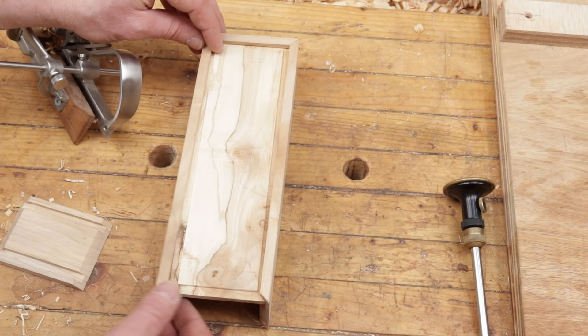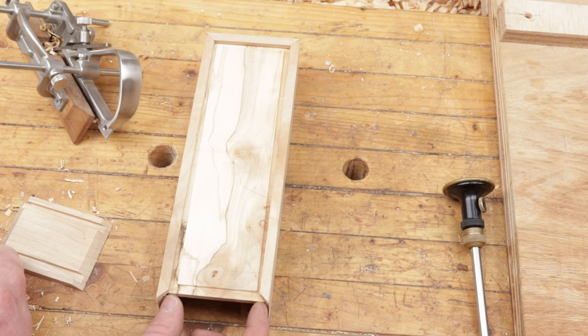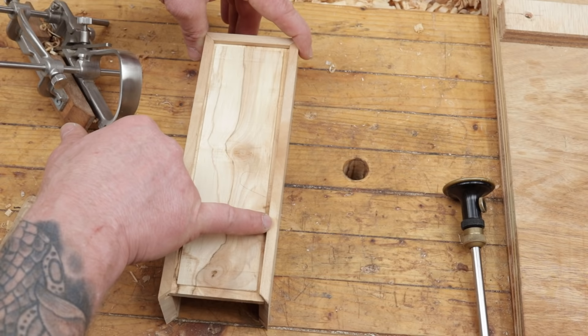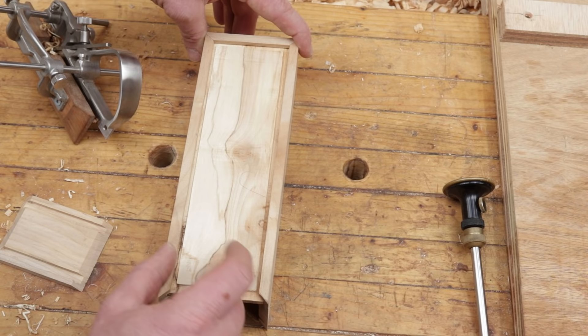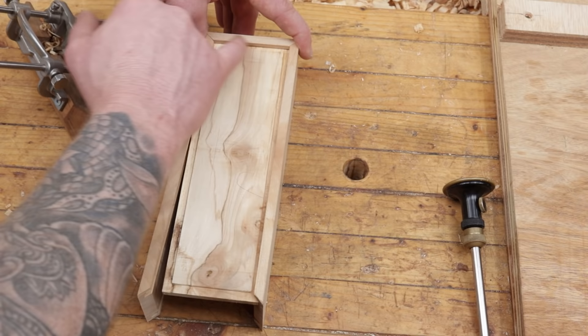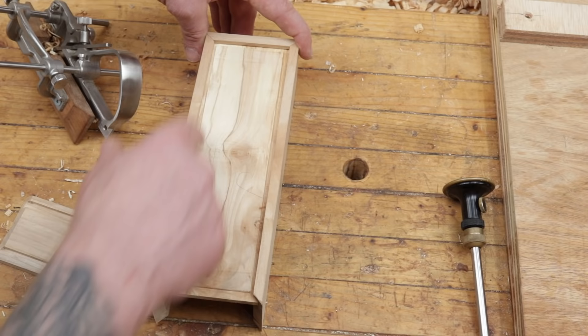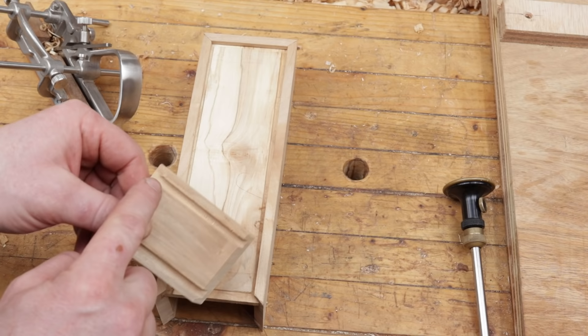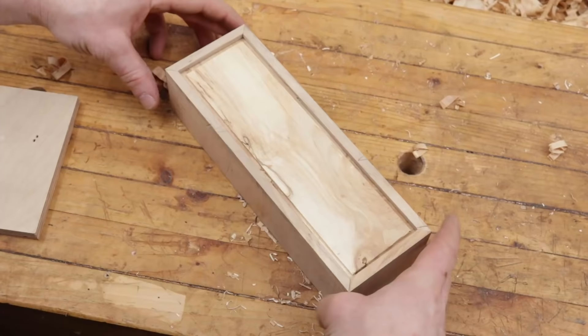There's our bottom piece — cut it out, squared it up, and put a rebate all the way around it. It's 3mm shorter than the actual width of the box including the rebate. Also remember to leave your shoulder line back from the edge — if the shoulder line butts up against the edge, that part of the timber can't expand and will push your box apart. Keep that gap consistent all the way around and it can actually be a nice decorative feature. You can even put a little chamfer on it. If you're using hardwood for the bottom, always allow for expansion or your box could end up in pieces.